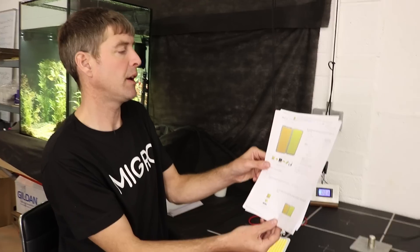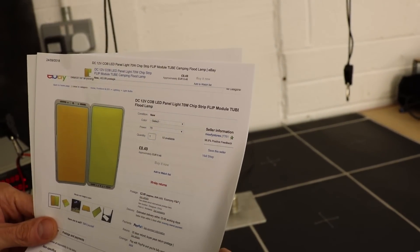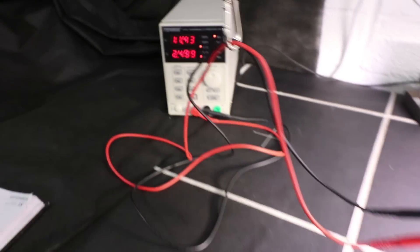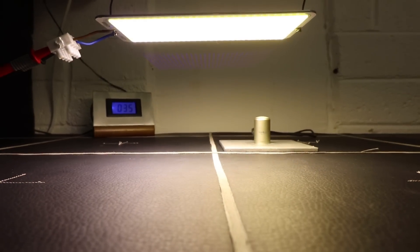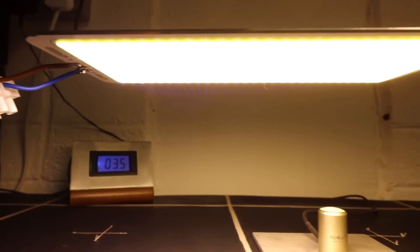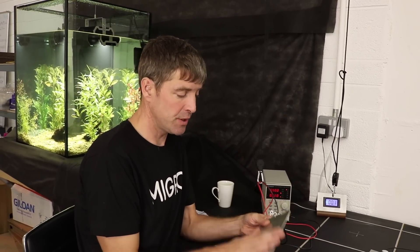It's described as a 70 watt. You can see the eBay advertisement here — it's a DC 12 volt COB LED panel light, 70 watt flip module flood lamp. It says it can be run from 12 to 14 volts and up to 13 amps, which it can't be. At 12 volts it draws about three to three and a half amps, so you would need heat sinking and possibly fans as well. But I've run it at 11.5 volts and it draws two and a half amps, which is the equivalent of 28.5 watts, and with that it runs cool enough — it doesn't need cooling on the back.